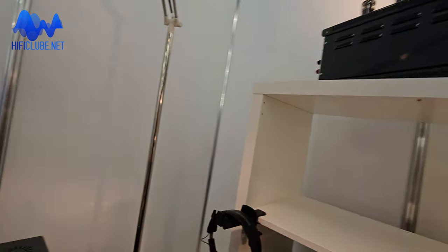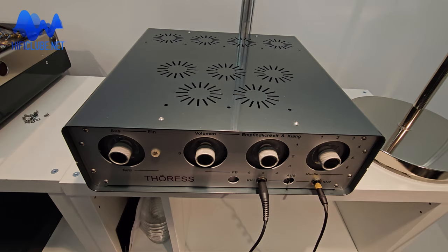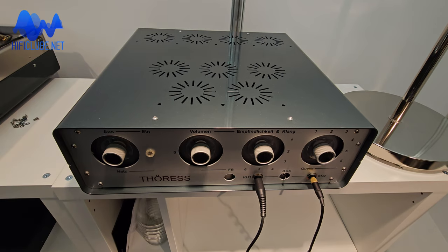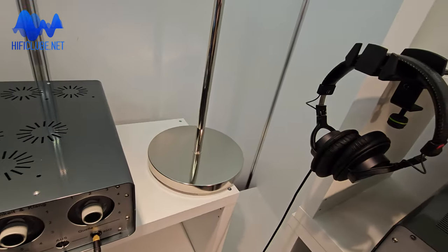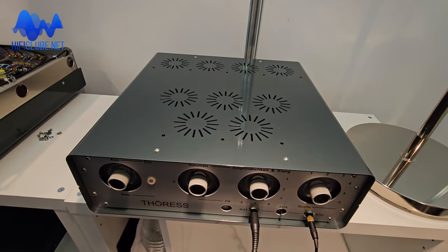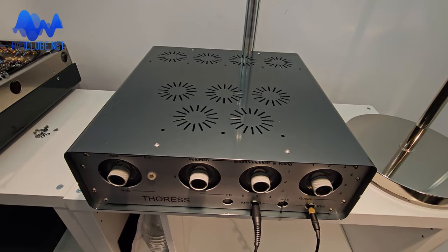And this one has a headphone output? I call it a dual-functional amplifier, because the same circuit serves as a line amplification device but also as a headphone driver. The output impedance is very low, and you can even connect headphones with impedance as low as 25 ohms, and drive them easily because of the power this amplifier delivers.